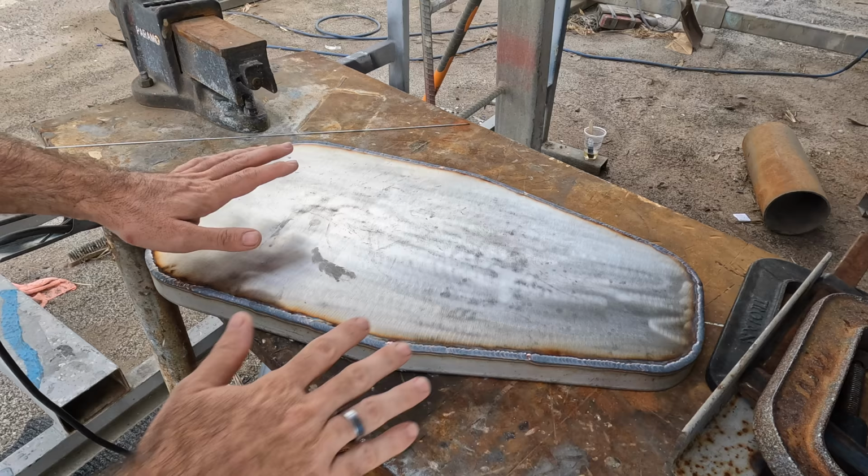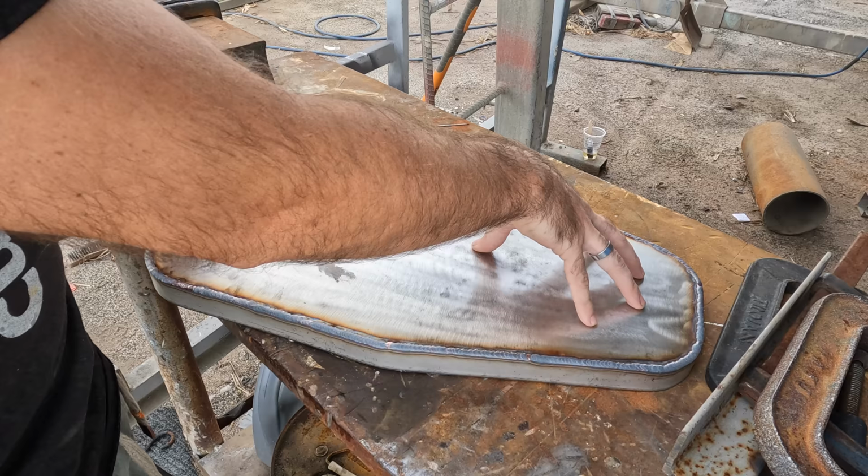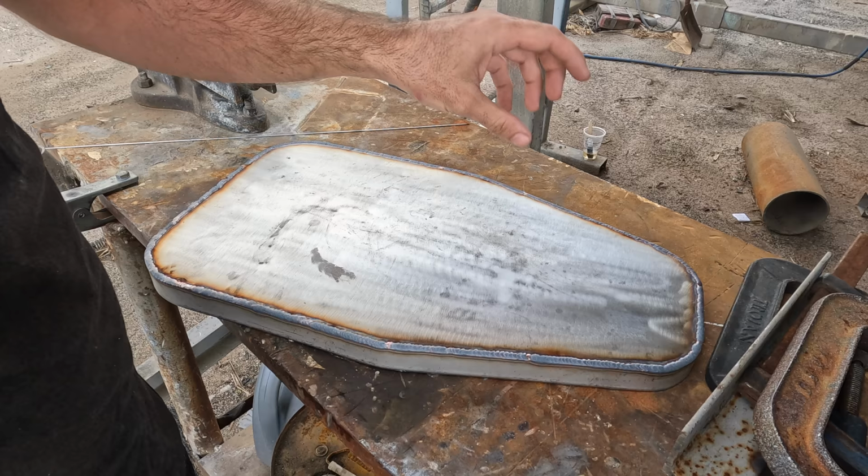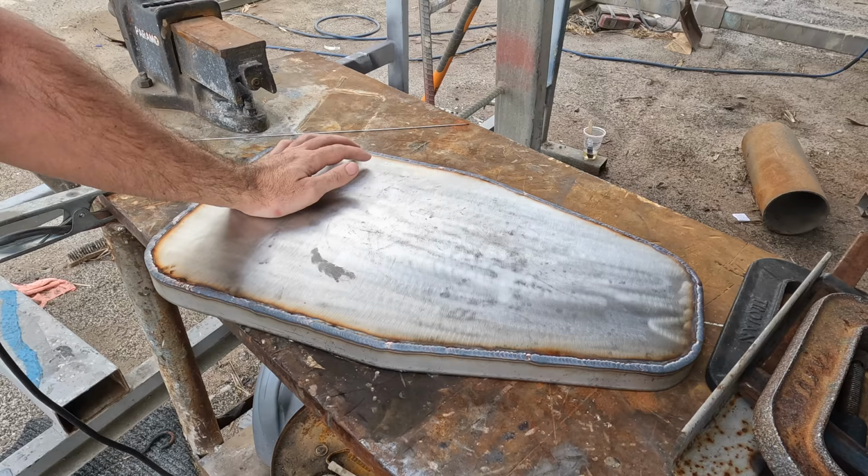It was great. Now that I know what I'm talking about, because I've read Ian's email, I'm going to go through and start working on the nav lights for Brupeg. If you imagine that this is the top of the radar mast bolts on up here, there's sort of like a big clear space at the back. I assumed that I could put a single round 360 degree light on the top here, and it would double as the anchor light as well as the steaming and stern light. I can't do that because of Brupeg's size. That would have worked if Brupeg was under 12 meters, but we're 17 meters, so therefore we have to do a slightly different light layout.